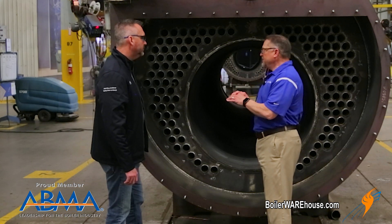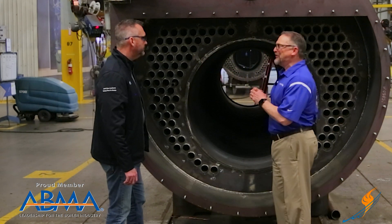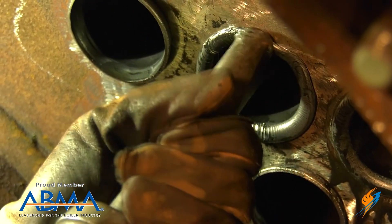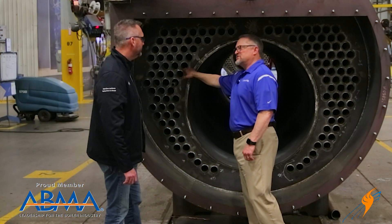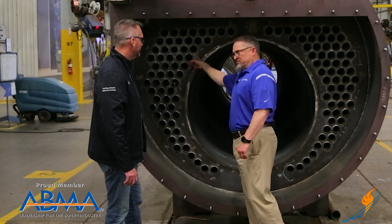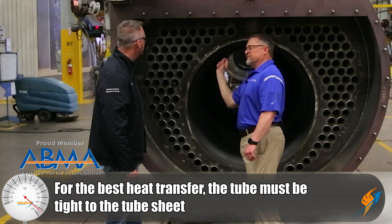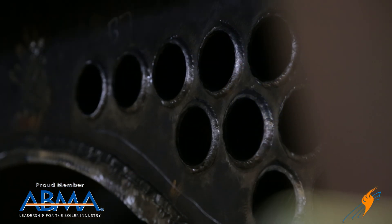We use what we call a three-in-one tool — a Wilson tool. In the old days you had a separate beader; you'd expand the tube, then take a beader mandrel and run it in — it was like a jackhammer, very loud and noisy. Now the three-in-one tool does it all in one process: it expands the tube to the proper expansion, then begins rolling the tube end over to the tube sheet. The important part with the bead process is getting that bead tight to the tube sheet. If the tube is too long, the bead gets too wide and can't roll over to the tube sheet properly.